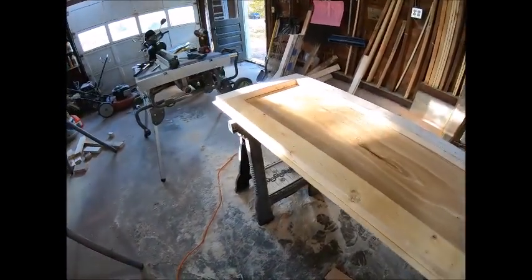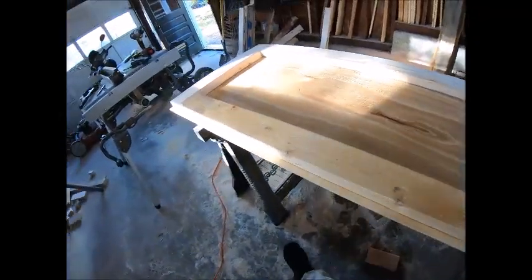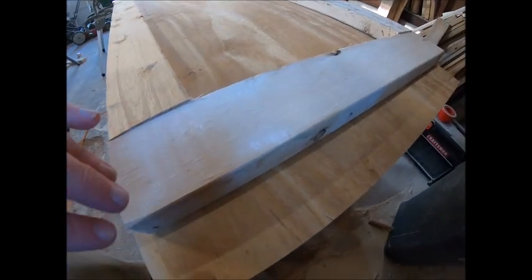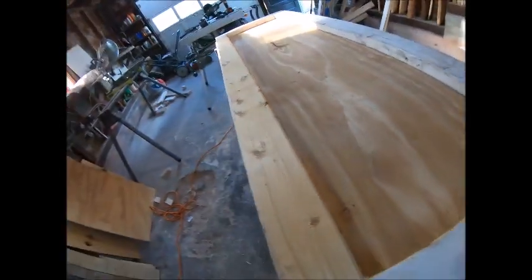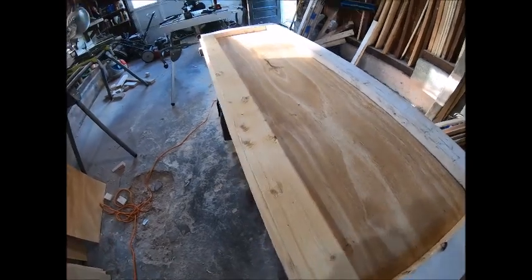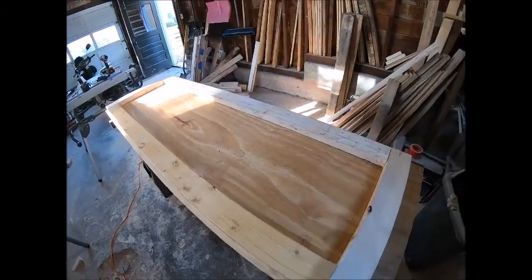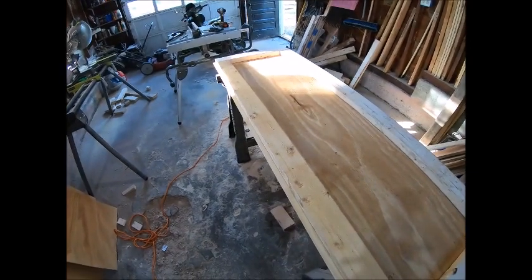So this is all I do to lay out the back side of the door. These are at 23 inches. These are at 63. This one's an inch from the edge, and this one's about 2 5/8, right around there, overhang, just for closure purposes. And this is basically the whole door frame, and then I put the trim boards on after. The first one I put the trim boards on ahead of time, which was kind of a bad idea. It took me a lot longer than it should have. So this one I'm just going to frame the whole thing out first.